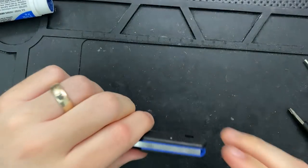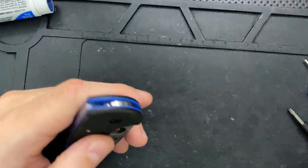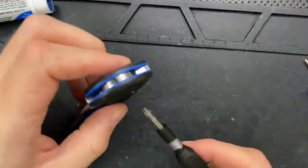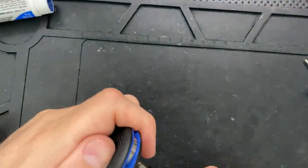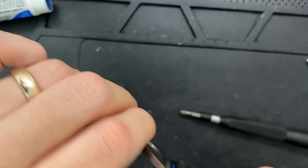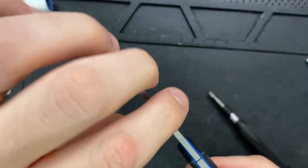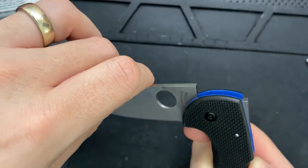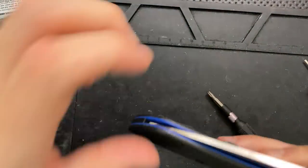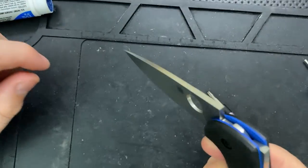Just seating this right here. So where are we at? No play. Reasonably smooth action — that's nice. I'm wondering if I can run this a little looser. Loosen just a little. Well, it now drops shut but there's a little bit of play, so let's tighten this up a little bit. Just the slightest little turns and twists. No play, and a nice drop-shut action for one-handed closing.